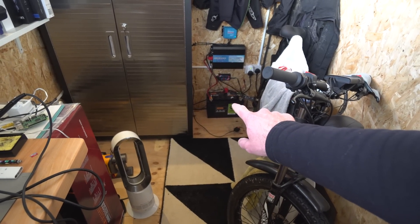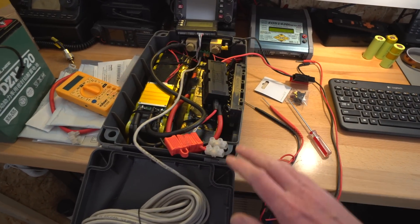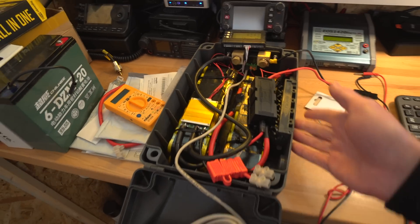For now I'm going to keep the leisure battery running, connect the charger to that, balance charge this mini powerwall, and run stuff from it as well. In effect we're sinking energy from the solar panels into that and then using it to more efficiently run the inverter and everything else. That way, whilst we're playing around, we're not going to have any incidents where it's just left charging and you don't know what's happening — you don't want a dodgy BMS from China causing unknown issues. At least this way I can control the charge for now.